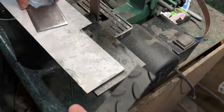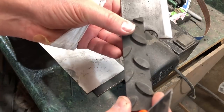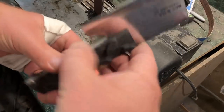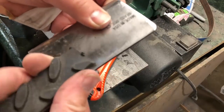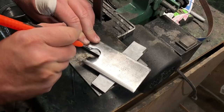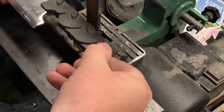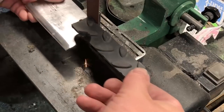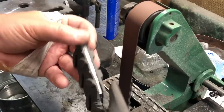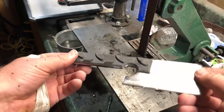Basically I'm going to trace the general outline of the shape I want for the grips, cut that out with a sharp knife, make sure the handle area is very clean, and stick these on there. Then for the final finishing touches I'll use sandpaper, the belt grinder, maybe a little bit of the Dremel, to give myself the contours I want and make sure it feels good in the hand. When cutting or sanding, be a little bit careful — it's easy to ding or scratch things up and create problems to fix later. Take your time, work gently, and trim away the excess.